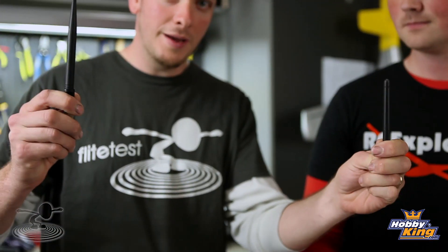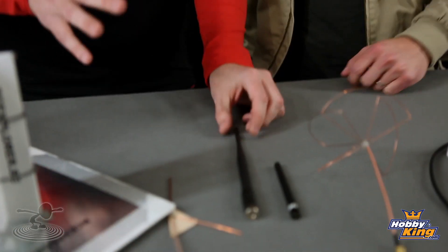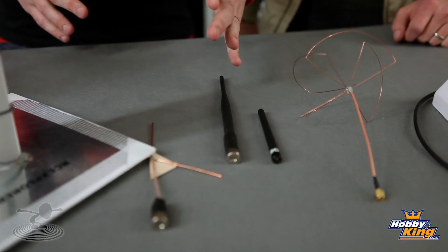Basically, in a real-world circumstance, you're flying away — here's the antenna on the ground, here's the one on the airplane. Everything seems good as you're flying away until you bank. And everything seems good, you're all happy, and then you bank and your picture goes bye-bye. It disappears almost completely — you lose like 26 decibels. That's a lot. So that's not a good thing. But this works in ground applications; that's why they're so common. They use it on Wi-Fi and everything because normal things don't fly.